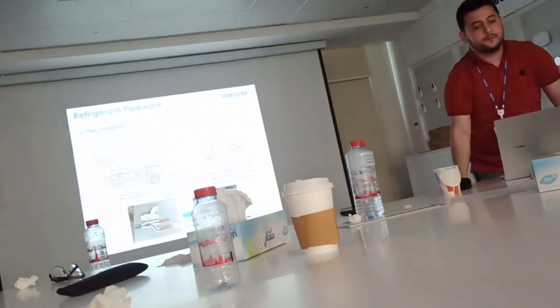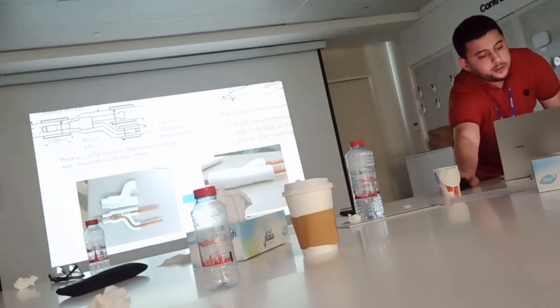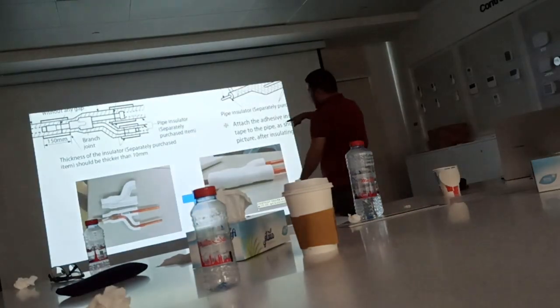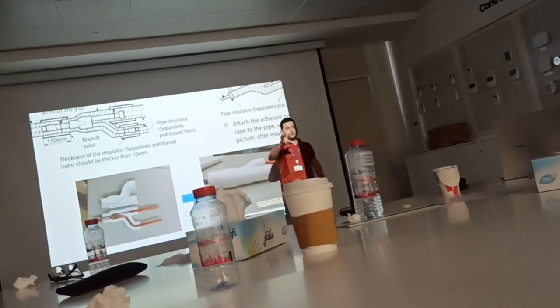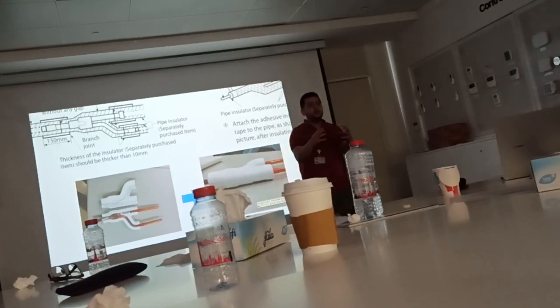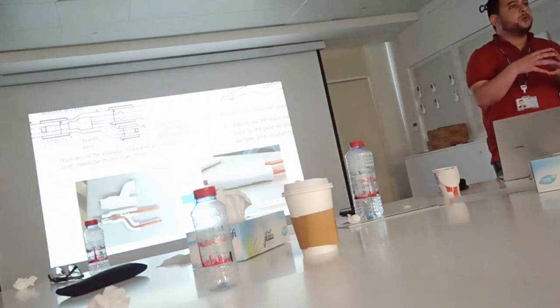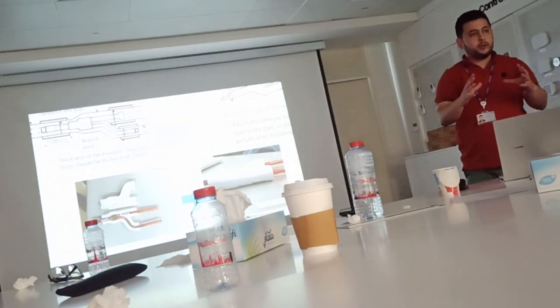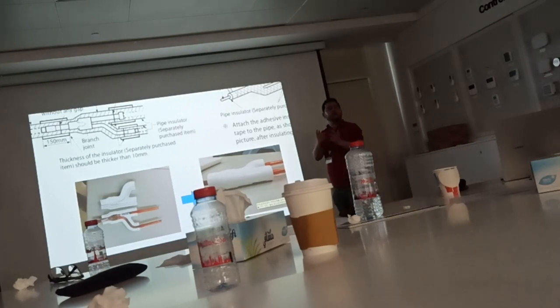Y joints. The Y joints are coming with insulation, white color. Some contractors think that this is protection-only packing, so they are removing it and providing their own insulation. No, this is wrong. These white pieces are the insulation for the Y joints and should be kept.